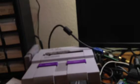So there's the double Donkey Kong that saves your progress for either game. And so Donkey Kong uses the small SRAM. I know Super Mario World uses the small SRAM, and the Donkey Kong series, but I don't know what other games use the small SRAM. But anyway, the ones that do use it, you can slice up the 64K SRAM to do individual save files. So just like you saw on the ancient stone tablets where there's 4 EEPROMs, you could in effect do a Donkey Kong Country series 1, 2, 3, and then the competition as number 4. And you could have separate save files for each one of those.